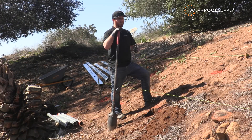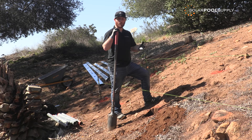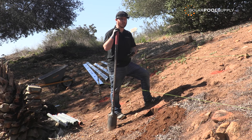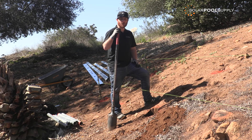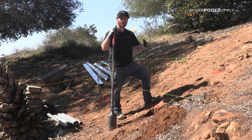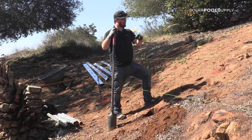So once you have done all your measuring, all the post hole marks and everything else, now you're ready to dig. I have already done this hole to show you. Typically for a smaller ground rack on a hill you only need to go about a foot and a half, maybe two feet deep depending on how soft or hard the dirt is. For this hole in particular, I went 18 inches deep. The way you measure how much you need to go is you use the front part of the hole — since we're on a hill, the front part here would be 18 inches from ground level down into the hole. You will repeat that for every hole.